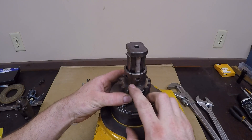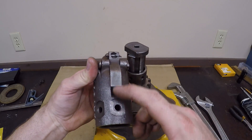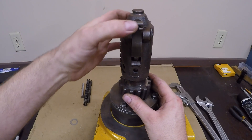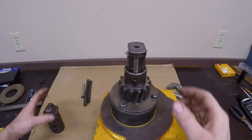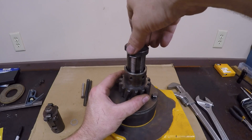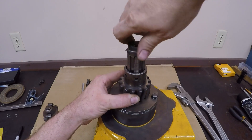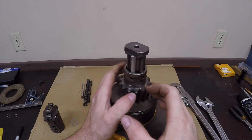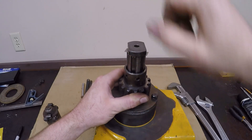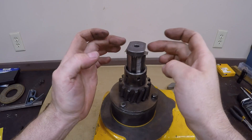You also want to look at the position of the shoulder on your latch nut versus where the bolt holes in the pinion gear are. We've got a bolt hole here and one here, with corresponding holes in the pinion sleeve. The latches line up with each one of those holes, so the latch is well in line with the shoulders on the nut — that's really good. But we need to get this fold-over lock aligned a little bit better, so I'm going to back this nut off and rotate that fold-over lock one slot back. We'll see where it ends up again — we're still not good, even further off from those two flats. So I'm probably going to have to add a small shim underneath this latch nut to get it to tighten in a better spot.